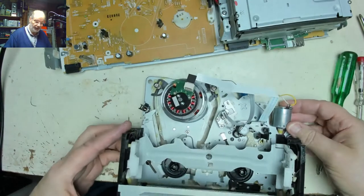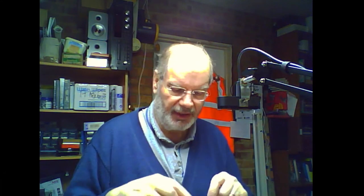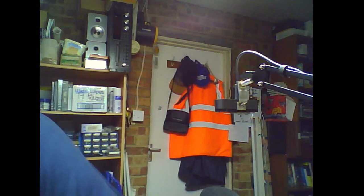He said that if that remote control battery cover had been in there and then somebody put a cassette in, that could have been strong enough to jam the mechanism, and cogs wouldn't jump because they're only plastic. So it's possible, extremely possible, that that's the case. So what we'll do, we'll just get the rest of the camera in for a minute. Get the rest of the mechanism out of the way for a minute. And come back to here.